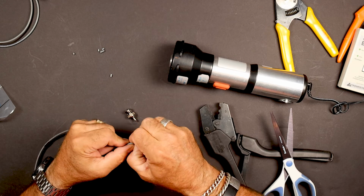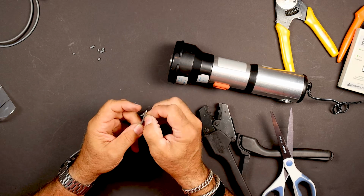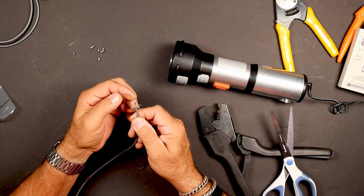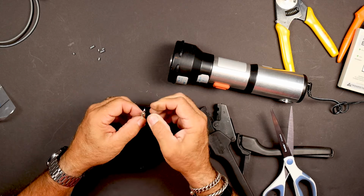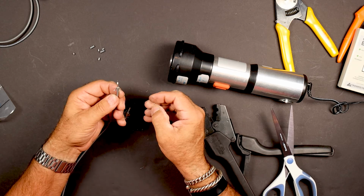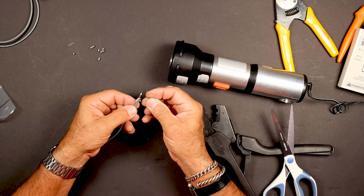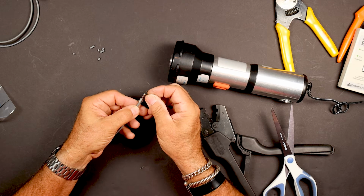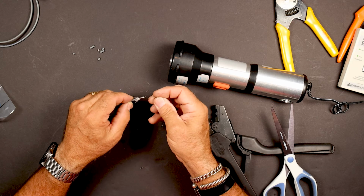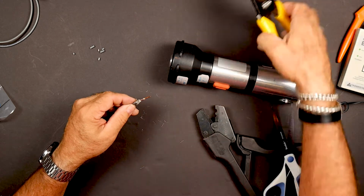Have to have a pretty reasonable fingernail to do that. Take all your braid. A couple little wires will drop off if you're cutting too deep into any of this. In other words, if none of the braid survives, or the foil completely comes off, or you don't have this little area here on your stinger, we want to have just the dielectric there so that we're not grounding this out. And if any of that is not looking correct and it won't go together correct, you probably just need to adjust the blades.